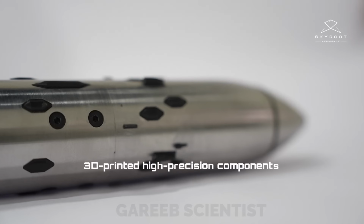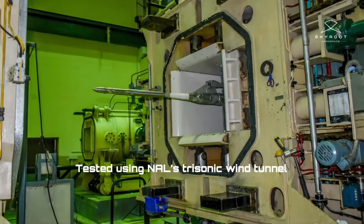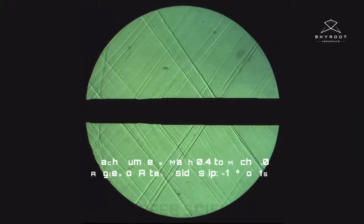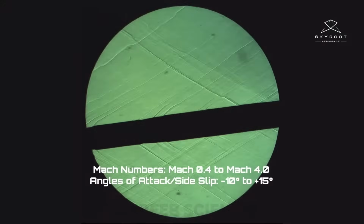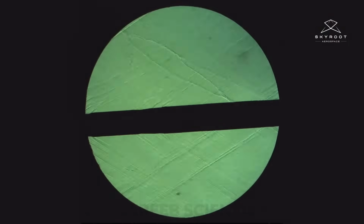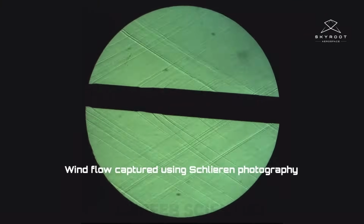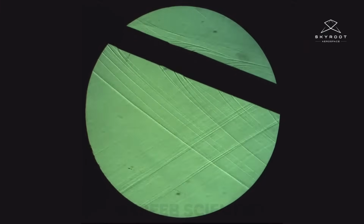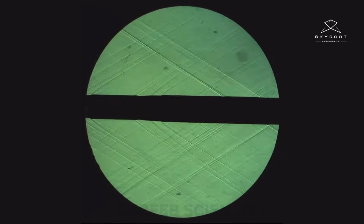That's why we do wind tunnel testing to validate as well, which we completed for Vikram 1. So we see that all the coefficients we require are as close to accurate as possible, and then based on that, all the sizing is done with some margins. So that it accounts for some delays or some changes. For example, during the design process, we keep changing slight dimensions and all. We keep some margins to absorb them.